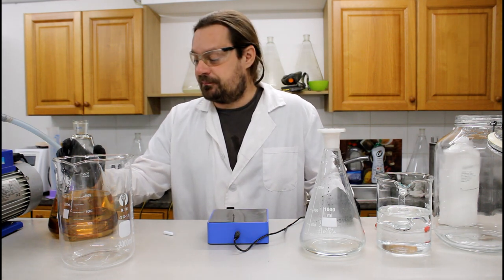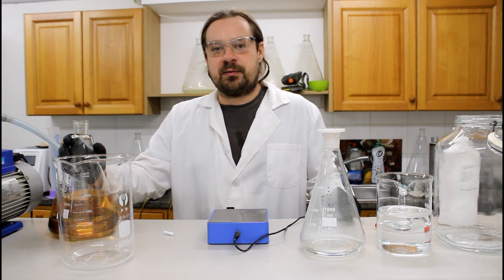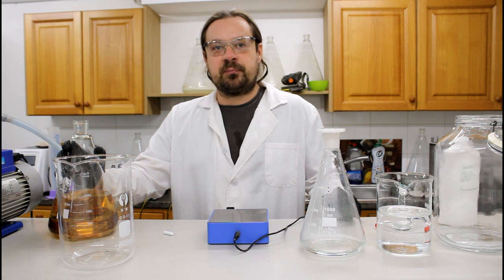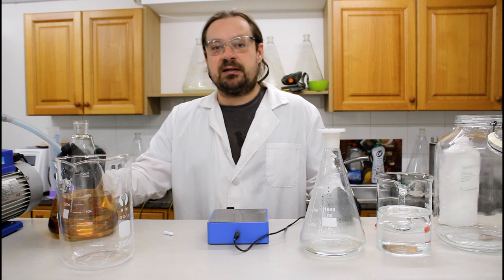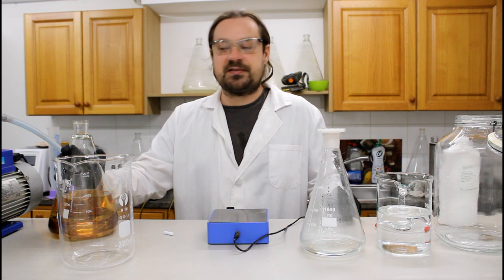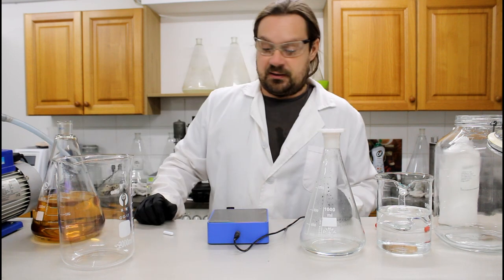and the like. So the idea is to lower the pH till we reach pH of 8.5, because at 8.5 we are sure that we have precipitated all the precious elements that I just mentioned, alongside with all kinds of other stuff. And in the next video I will try to recover the precious elements out of this solution. Okay, let's begin.